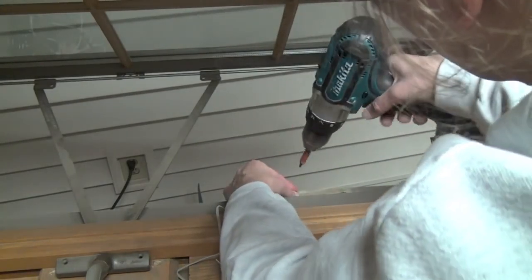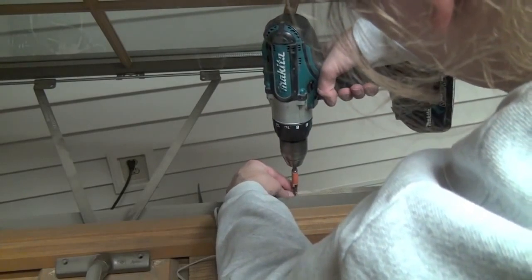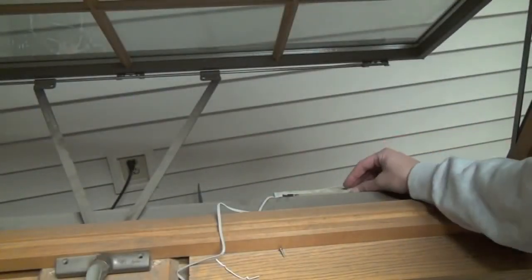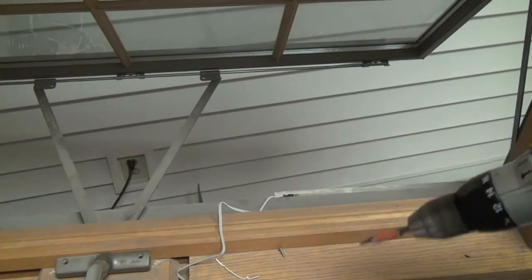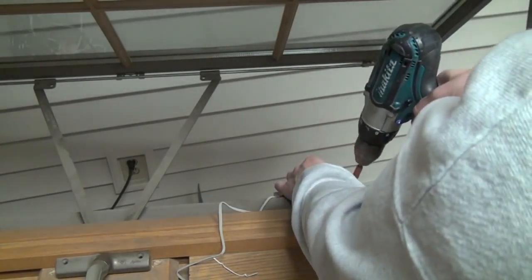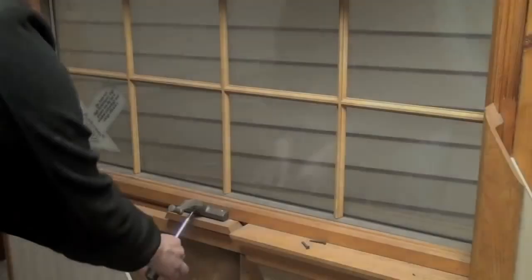that comes with your power operator. Screw the rain sensor to the windowsill or a surface where rain will reach it. You can hook up to 4 windows to the same power supply, and only one rain sensor is needed for each power supply. When rain falls on the sensor, all of the windows connected to the same power supply will automatically close. So be sure to install the rain sensor where it is most likely to be rained on.